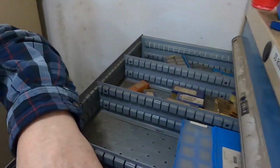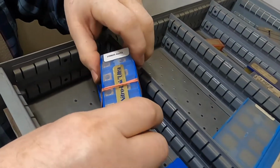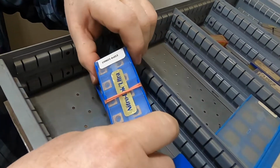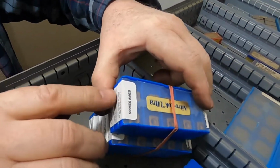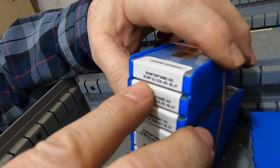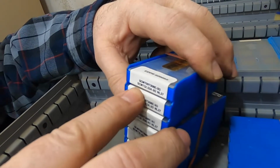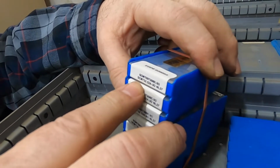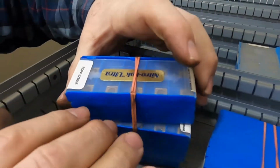Just try and go through and glean some information we can out of these. This one here is the C shape. No, that's a C clearance, excuse me. It's still square. Okay. And this is a square positive. And that's something too. Besides P, there's other positive clearances. P is the most common generic, but C is another clearance, and you'll see this as a really common clearance, and I think the C was less of an angle than the P, but I forget. They're different. I don't remember.